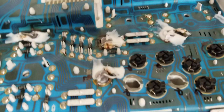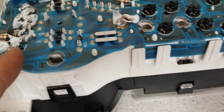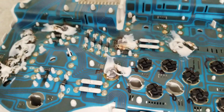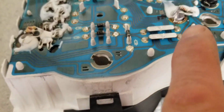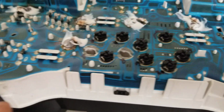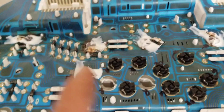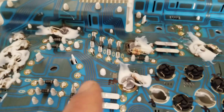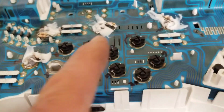If you wreck it, like PC board traces and stuff, then you have to install some bridges like wiring, and it's not a pleasant job for some. What I noticed here, some of these bridges, especially at the diode level, I had one broken. I don't know if it was a vibration or me putting pressure on this flex cable or flex traces.